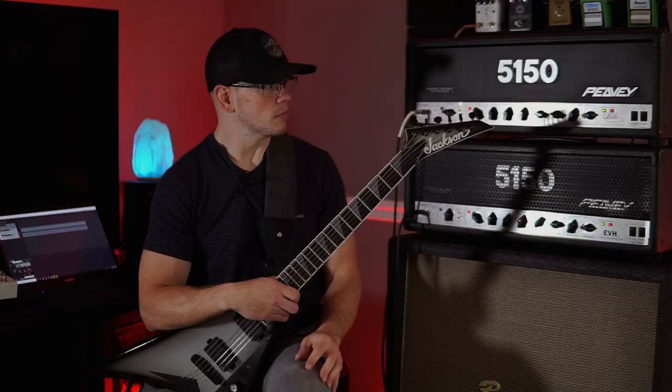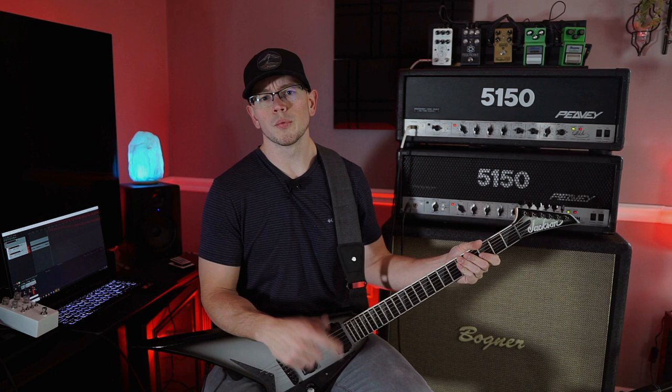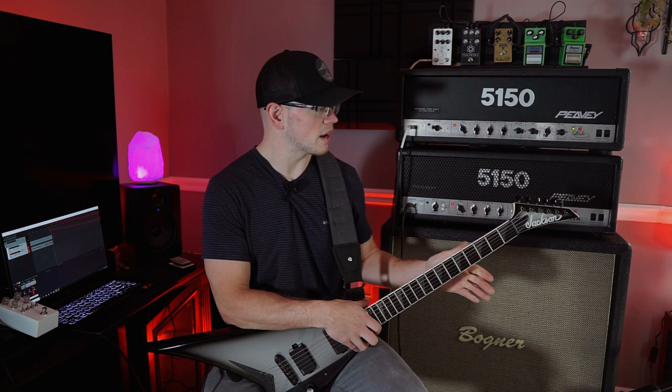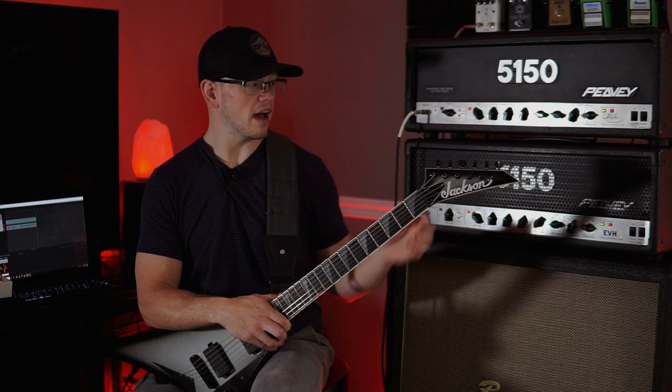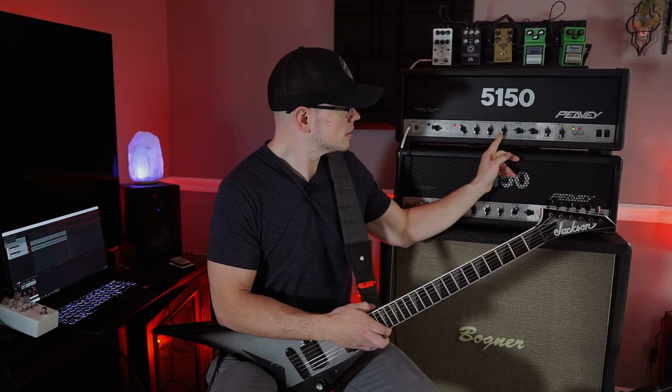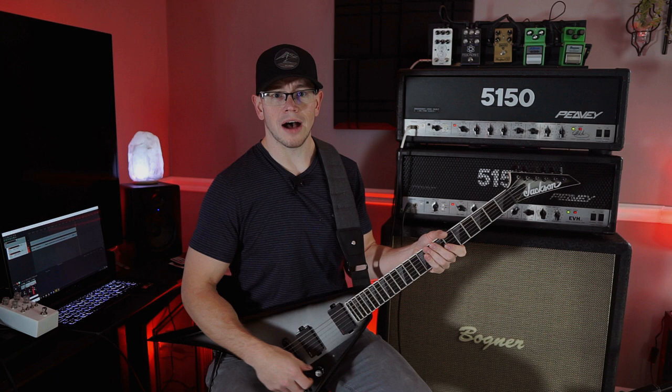Anyways, I had them dialed in exactly the same. As you guys can see here, they are set exactly the same. They both have Ruby 6L6 GC power tubes. They both have a Tung-Sol on V1 with JJ across the rest of the preamp. So what I'm going to do is set everything to noon, including the resonance and presence on each amp. We're going to dial the gain down to about two and a half on each amp and shoot them out to see if we can get them to sound the same. Right now we're on the block letter.